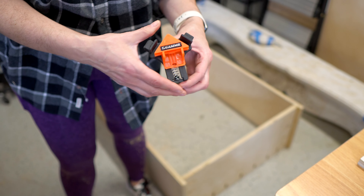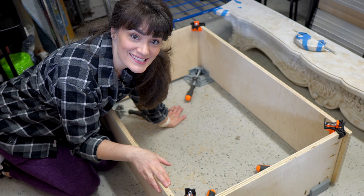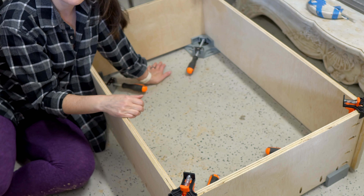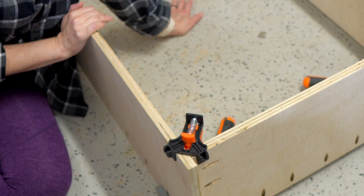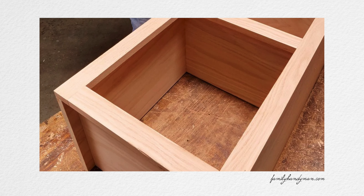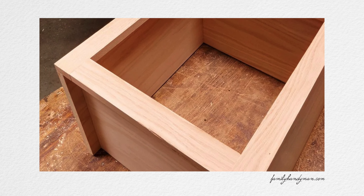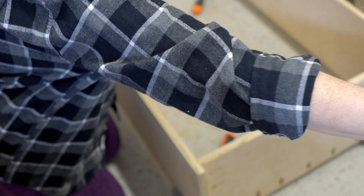This is my little small set of spring-loaded clamps — what's nice is that little triangle part is also adjustable. So I signed off last night, turned up the Taylor Swift, and got to work. I realized that I put the bottom too low — I made it a full rectangle shape, but that's not what we want to do since we have the face frame that's about one and a half inches wide. To account for that one and a half inches, and since our cabinet board is three-quarter inch thick, I had to push the bottom up three-quarters of an inch so that the bottom shelf will be flush with the face frame. That way there won't be a lip when you're grabbing your stuff. It's a tiny design detail, but I went ahead and took the 15 minutes to fix it — it's going to make a big difference.